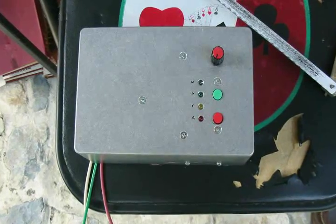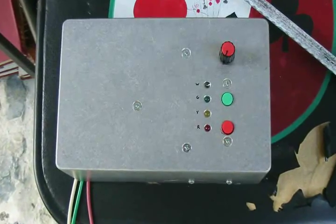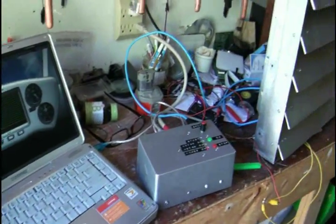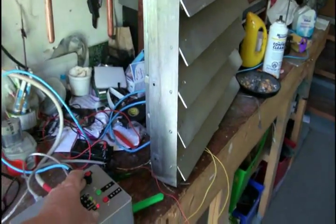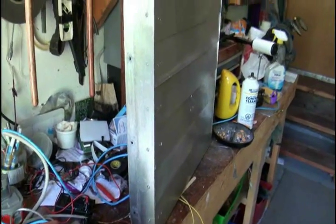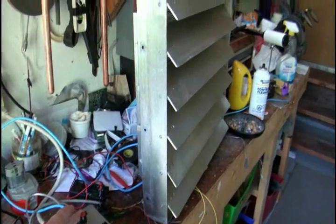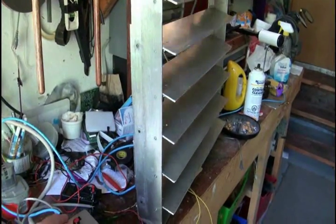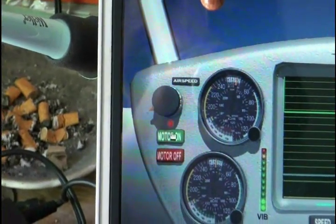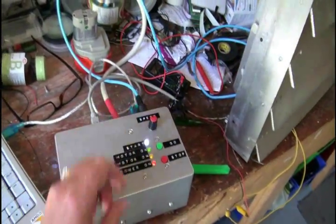All of the sensor data is processed in the rugged control box. Basic controls are on the panel, with status indicators and buttons in standard industrial colors. The control box also switches the big wind tunnel fan motor and controls airspeed using louvers that open and close. Here the airflow almost stops, and here it's full speed. The louvers can be controlled by the software knob with a mouse, or up-down keys on the keyboard, or by the panel knob.